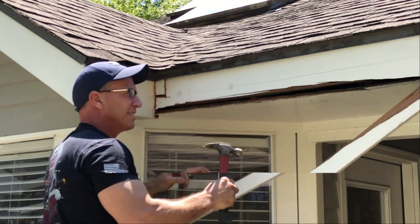There's going to be a backer board on here — sub fascia. I found termites in here at one time; now they're dead and it's all dry, but they didn't change the sub fascia. I'm going to go ahead and pull all of this fascia off as well, now that I know they had a problem in here. That's why I saw a little rot in the corner that was patched and never done properly — I want to fix that and just make it look right. Next we're going to cut out this corner and remove it.